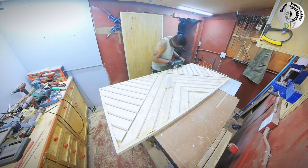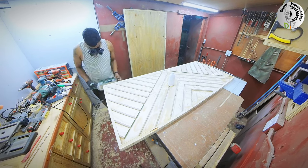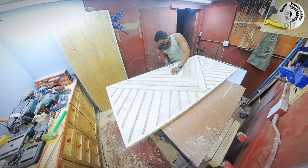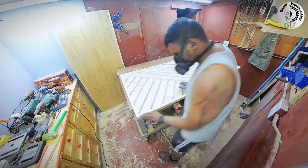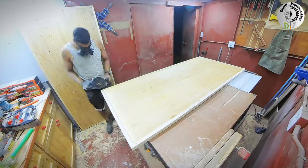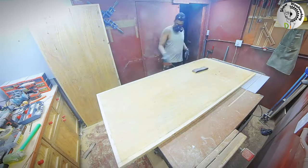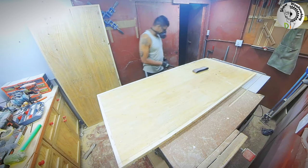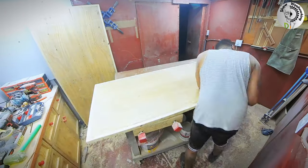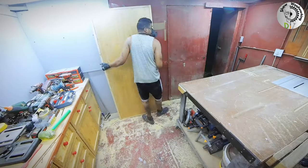I filled the small gaps left after gluing on the trim edges, then followed up with 100 grit sandpaper on my belt sander to sand everything flush. After that, I used my hand sander to chamfer all the edges so I wouldn't injure myself handling the doors. Then I flipped it around and used my flush trim bit on the router to flush the trim to the door panels — quite a messy process. I came back again with the hand sander to chamfer the edges, then clamped the doors together to keep them straight overnight.